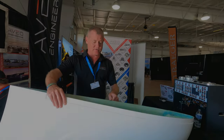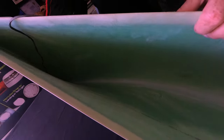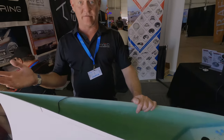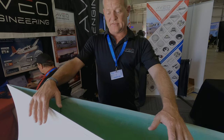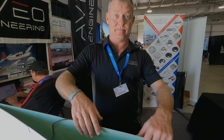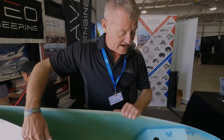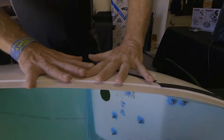Now, speaking of the 8 molds, one thing we've got going on with this is that we're using AirTex foam. That's all those little white dots. That's a real thin layer of AirTex structural foam. That's not used in any other tips that are available. We sandwich this in between layers 2 and 3 of the glass, and then we vacuum bag the whole thing. So this is not a hand laid up tip. Every last heavy drop of epoxy is sucked out of this tip in the vacuum bagging technology with some AirTex foam. We also have a structural bulkhead that we mount the lights to that gives you additional rigidity.